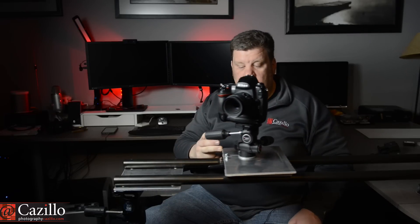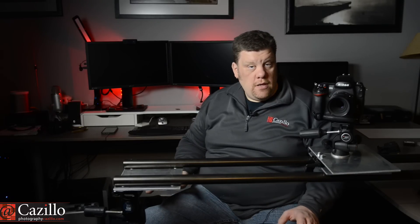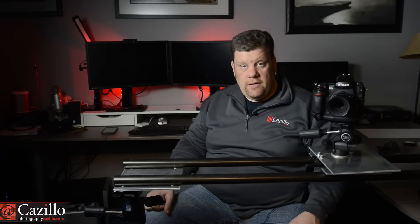So that is my DIY slider. Check out the original video that was all over the internet probably back in the fall — it had a lot of views from a guy over in the U.K. Use my parts list and go by his. I used a drill press to get nice, straight holes. You can borrow one from a friend or go right to a machine shop. The other idea would be to use a handheld drill if you really wanted to — just do your best to get those holes nice and straight. Maybe have someone help you keep the holes straight as you're drilling them.